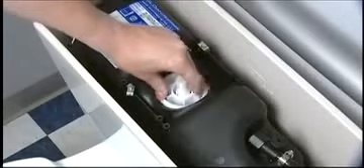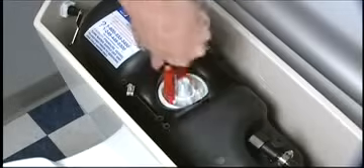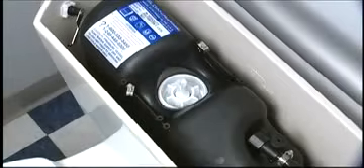Reinstall the cartridge by turning the cartridge assembly counterclockwise while pushing down and applying pressure to avoid cross-threading. Stop when you hear an audible click caused by the threads engaging. Next, turn clockwise to install the cartridge back into position until a thread or two of the FlushMate unit are showing above the cartridge.